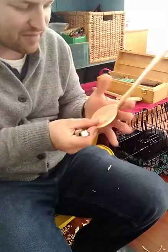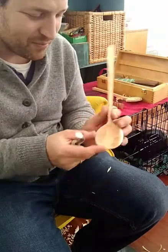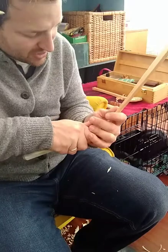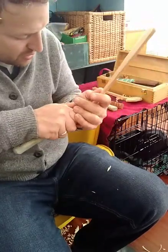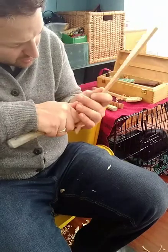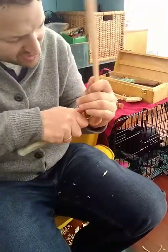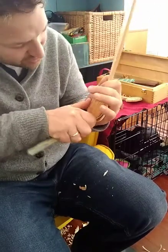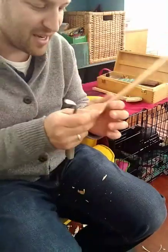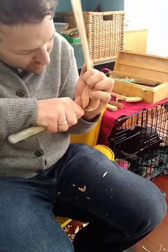Heavy lifting with carving usually involves squeezing the wood in various ways as you stabilize it, and I've actually crushed eating bowls in my hand by needing to do too much of an aggressive cut at the end when it was at its most delicate. So this is the time where I want to get everything to the same level of delicacy. I want to basically get everything to what could be a finished surface and then just keep swirling that finished surface larger and cleaner.